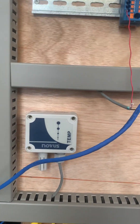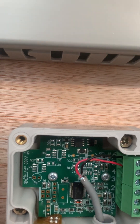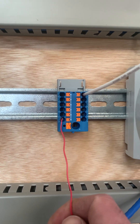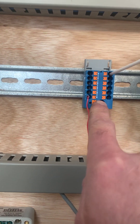I'll show you the way this one's wired. We've got one of these transmitters here — dead simple. We've got a plus and a minus, and that's taking the four to 20 milliamp signal back here. This is just a distribution block, so all of your eight or ten transmitters could come in here and get their 24-volt supply.